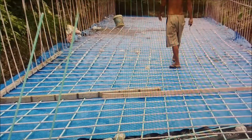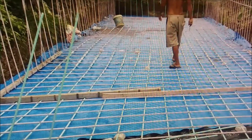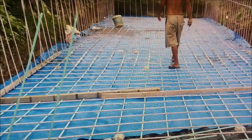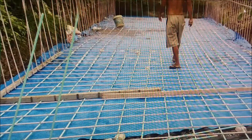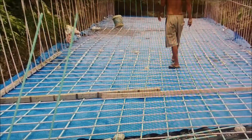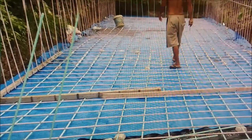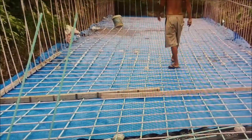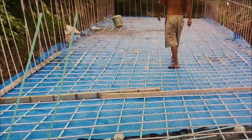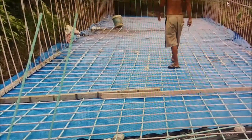At this point they've got the bars pretty much all the way around and they're putting one bar up near the top — you can see it over here — just stuck on there to keep them from falling over. We have another notch board with a pattern — bars closer near the edges: inch and a half, then three inches, then five inches, then 10-10-10, then closer together again at the top. We do slip forms on these, so we have to put the bolts in the holes or you can't slip it up — there's no place for your anchor bolts. They learned that the hard way.